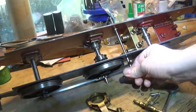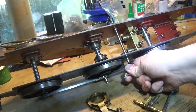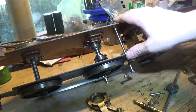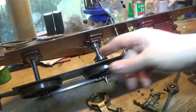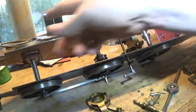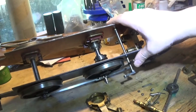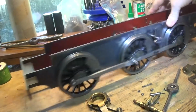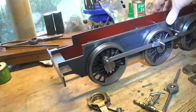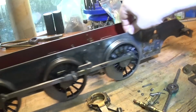Still, that's quite firm there. It's probably a good fit and it doesn't move much. This is the lift arm, and we're probably going to live with it. But these two bushes didn't quite line up, and we've spent a fair bit of time straightening this out, basically with a couple of blocks of wood clamped on the bench and another block length of timber clamped on one end to straighten it up and get it somewhere so it's about square. So I'm really pleased with that. And as such, we don't have tight spots now. So that's really nice. Really pleased with the way that's come together now. So bit of work there, but we've got a chassis that runs backwards and forwards.